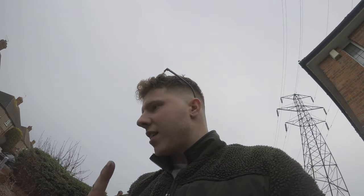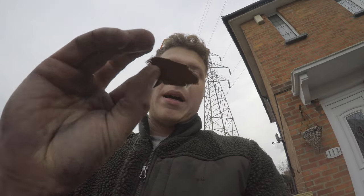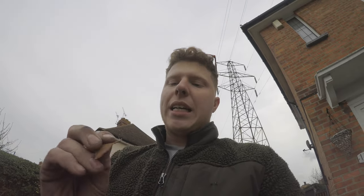This is the first time I've actually flipped the boat over since getting it, and the first thing I've noticed is this — the water barrier sheet has a small hole here, so I'm going to patch that up. Now it's over, I'm going to check the rest of the boat for any other obvious damage. I've grabbed a little bit of hypalon, I'm going to put that over the hole. A bit of contact adhesive on the floor and on that part — I've sandpapered it up a bit as well — and then we'll stick it over the top with that PU sealant. It's waterproof and works really well with vibrations.